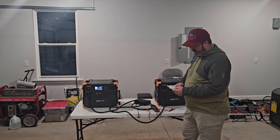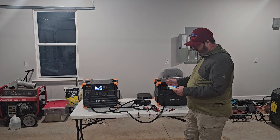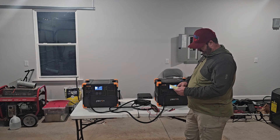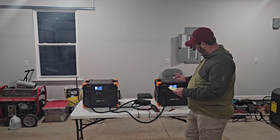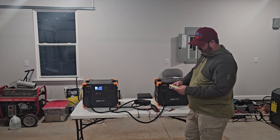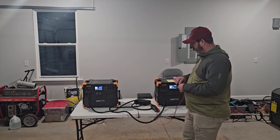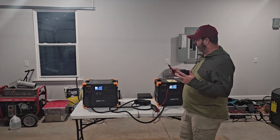One of the first test items they wanted me to do was unplug the network cable — that has been done — connect the 240 voltage hub, power the units on, and check the voltages between line one and line two, and take a photo of whatever error message is present, and record what the voltages are between line one and line two. Right now I've got the power stations turned on. They're powered up. They're both in 120 volt, 60 hertz mode.